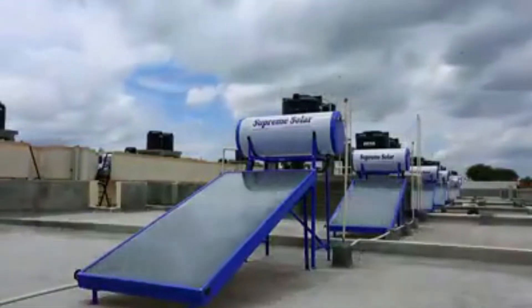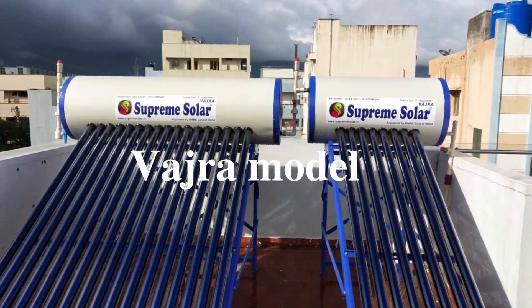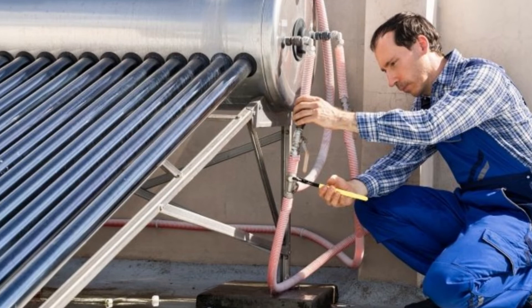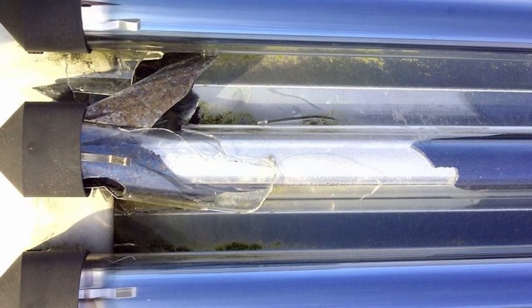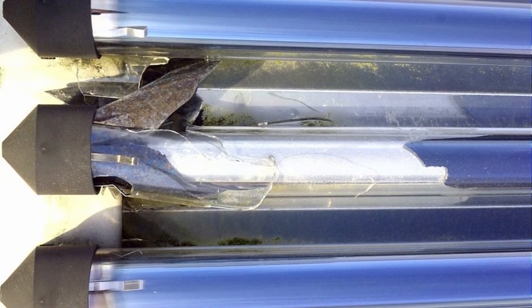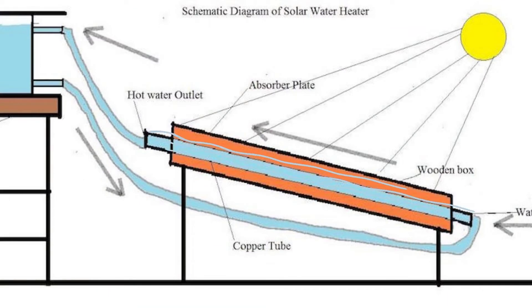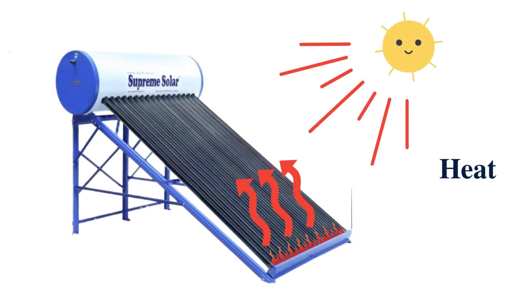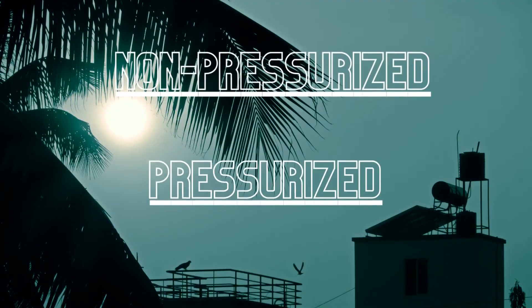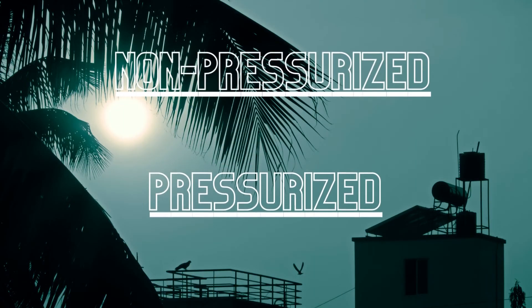When something falls on a flat plate model it won't break, so when you have kids who might damage the solar water heater, go for flat plate models. Up next is the Vajra model — it is a tubular model in pressurized. Since tubular models are normally not strong, they get damaged easily and are not preferred in pressurized, but this variant is different. It will not break during the water heating process because instead of water circulating inside the tubes, it is heat that circulates in the tubes and then goes inside the tank to heat the water. So the pressure pump's pressure doesn't harm the tubes. The Vajra model can handle up to three bars and its warranty is two years.